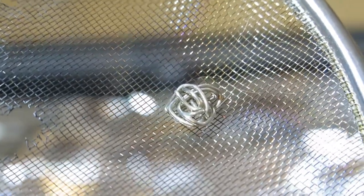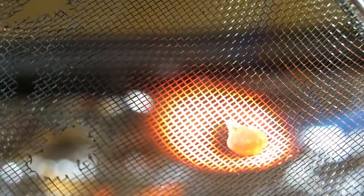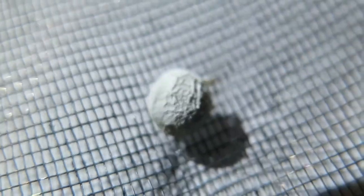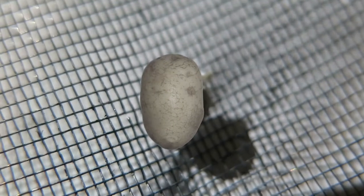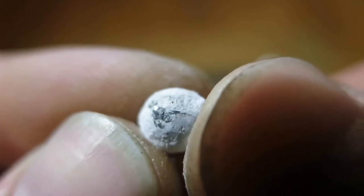So I was interested — what exactly do you need to create the stuff? I'm trying to repeat this experiment using lead-free solder and a bit of human hair. Here we have this uniform oxide coating, and now it seems to be reduced or evaporated or destroyed or whatever. For a moment there was a flame, and then this rapid flattening, almost wetting action. And then nothing. This is a quite magnified view after cooling, and as you can see we got a potato. The oxide coating was very easily removed and after scratching the surface you can see that it's shiny and metallic.